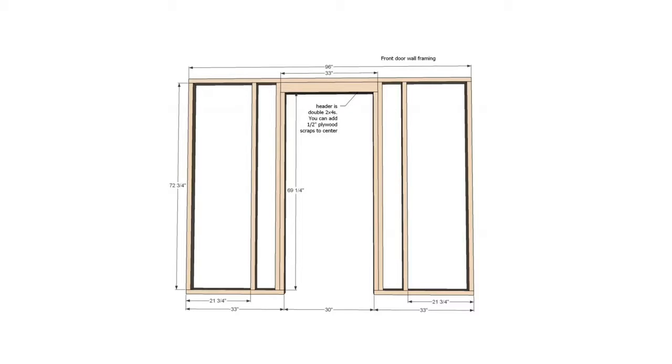If you truly look at and understand the way a door is installed, it's more like a house guest than part of your home. We need to take that door and make it more like part of the wall — part of the wall that opens when you want it to. Behind your flimsy door jamb are two 2x4s on either side, and these studs are integral to the structure of your home and can withstand much greater force. The very first step is to tie the door into the rest of the wall.